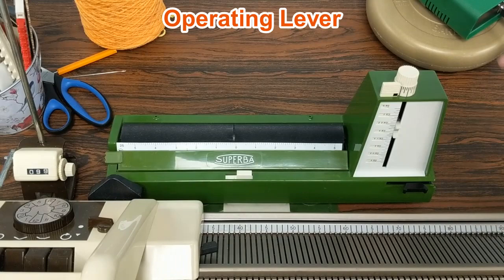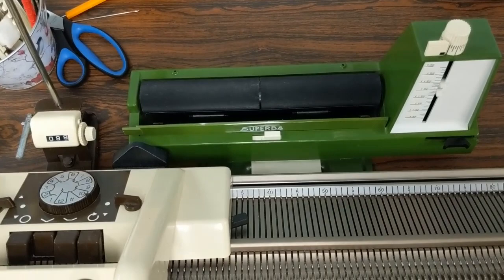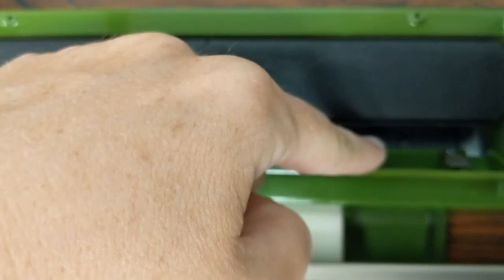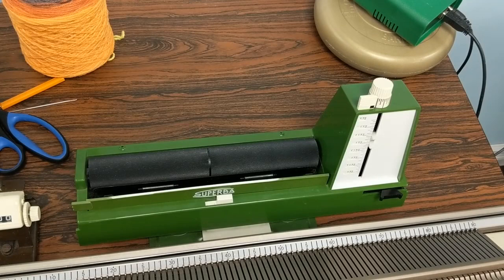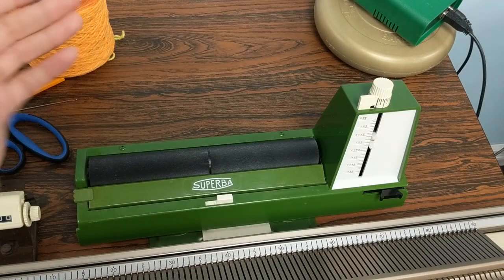To adjust how the row counter tripper is hitting the pattern driver tripper, lift up this flap and take out your stitch scales. If you look down inside the unit, there are two regular flat screws. If you loosen those, you can slide the whole unit forward or backward as necessary to get the adjustment just right. Once the unit is attached and adjusted properly forward and backward, you're ready to make a swatch and start using it — but that's a subject for another video. Don't forget to hit like, subscribe, and share if this helped you. I'd love to hear from you if you have experience with the Forma or any questions. Thanks and happy knitting!